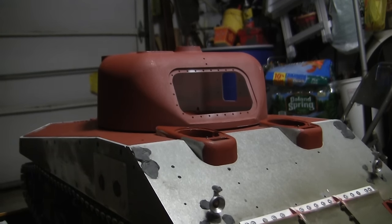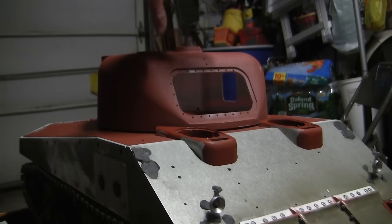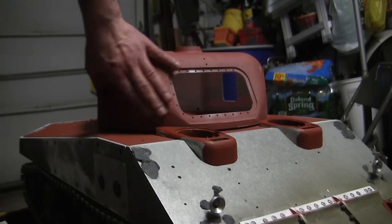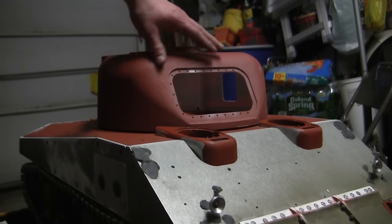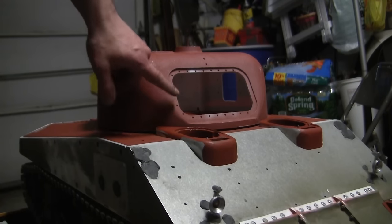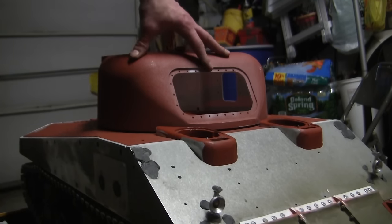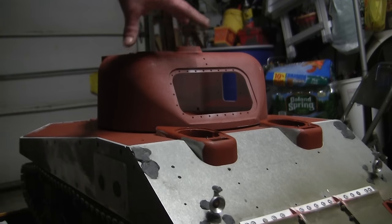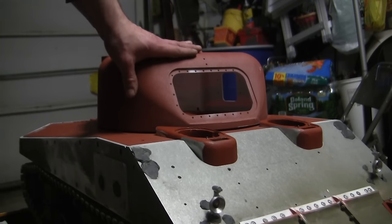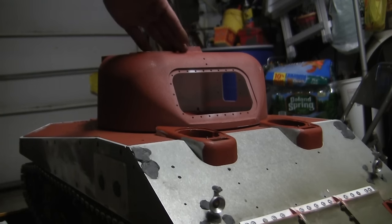As you can see from the way the turret performed, it did perform nice and smooth. However, there is some sluggishness in some corners. This will be addressed with some sandpaper, removing a little bit of material from the ring, as well as possibly even from the turret neck. With this material removed, as well as the grease added to the bushing, the turret will perform a lot smoother compared to its first initial test run here. However, for a first initial test run, the turret performed pretty good.